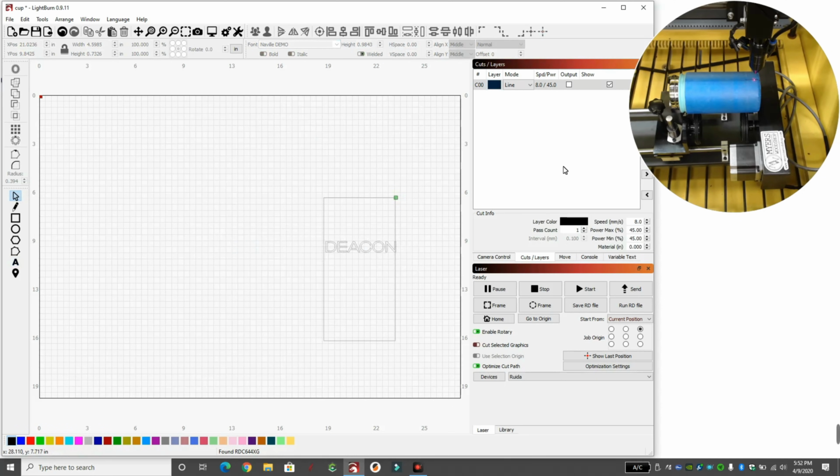So this is our cup. If we did it this way, I'm going to turn this one to blue again, where my laser isn't actually firing. I just want you to see. I'm going to click here and shrink it down to the center. Remember that this is where our starting line is, right here at the top. If I do it anywhere near this line, it's going to start right here. If I do it in the center, it's going to do it on the back side. If I do it over here, it's going to do it in reverse, on the reverse side. Let's put it right here so we can see how it goes. If I hit start right now, remember I don't want the black line on because I'm not outputting the square. It should do it right here, and hopefully it'll do it across.